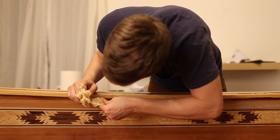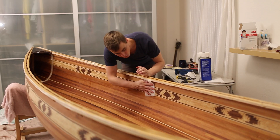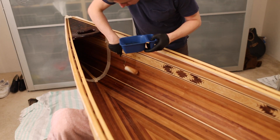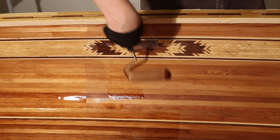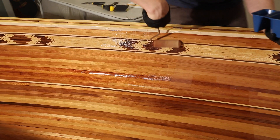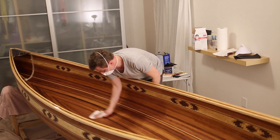After the fourth coat, I take the tape off and put new tape on the gunnel, leaving a little bit of the varnish section showing. I rough that up with sandpaper, then clean the inside of the hull with acetone and tack cloth. I apply the varnish for the hull sections a little bit differently than I did for the trim. I roll the varnish on with a four inch foam roller, then I use a clean paint brush to smooth it out. It actually smooths out pretty easily. You want to work carefully and quickly, making sure you keep that wet edge. It's a lot easier if you have someone rolling the varnish on and someone else painting it out. I do four coats on the inside too, with the same roughing and cleaning process in between each one.